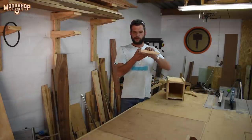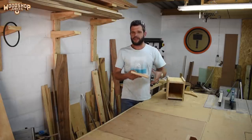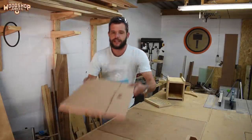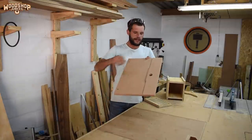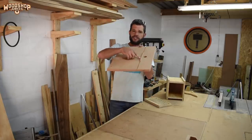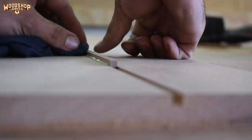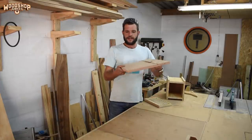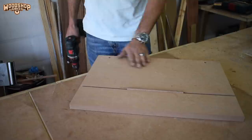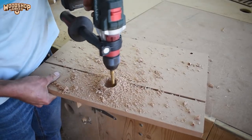The base of my drawer is a piece of six mil or quarter inch MDF, so the slots in the unit need to be the same thickness and created with uniform spacing. To do this I made up a jig using some off-cut MDF — I made a slot using my router table, a quarter inch or six mil slot, and then cut a piece of six mil MDF and glued it in the slot with it protruding slightly. This will be my guide when creating the slots. I also made two holes to fix it to the slots on my router table, and a hole for the router bit to protrude.